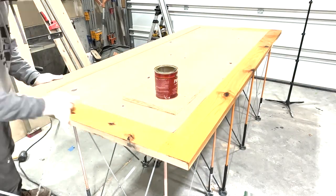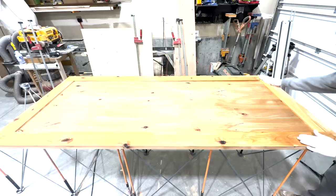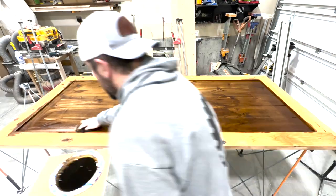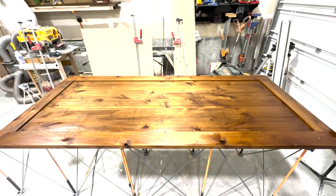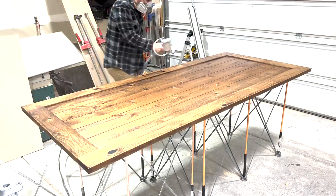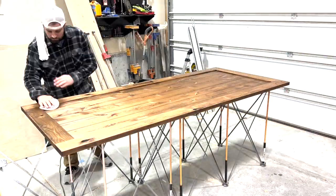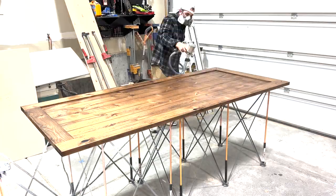Now it's finally time to stain. For softer woods like alder, I like to use a pre-stain wood conditioner — this helps avoid blotching and makes the wood accept the stain more evenly. After you let the conditioner sit for about 10 to 20 minutes, wipe off the excess and you're ready to stain. When staining large surface areas like this, I prefer not to use a rag but instead a staining pad or even lambswool — it holds a ton of stain and covers a lot more surface area in less time. Wipe off the excess stain immediately after you're done. After letting the stain sit for at least a couple hours — I prefer overnight — you're ready to put a clear coat on. I do a minimum of two coats, sometimes three, sanding with 220 grit between each coat after it dries. This small sanding process between coats will ensure a really smooth and professional-looking finish.